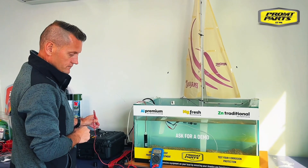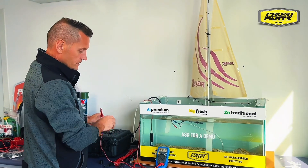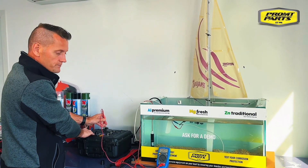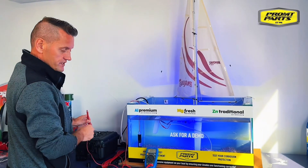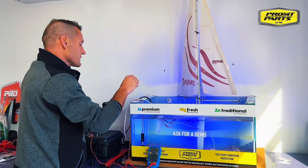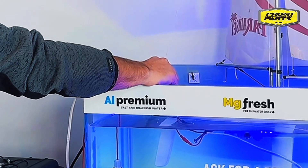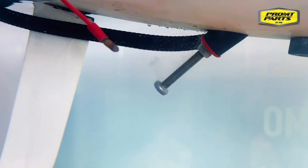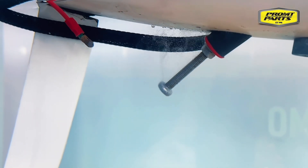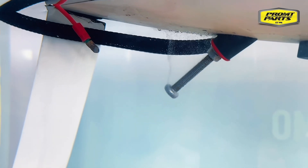We've got minus 890 millivolts on the meter. As we turn our light on, we see that value jump up to 1.8, 1.7 volts — so there's a very bad leak with the live bait tank connection underwater. That is creating a stray current and all of the underwater metals in here are starting to dissolve. You can see there are actually bubbles coming off them now.